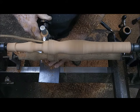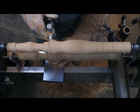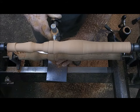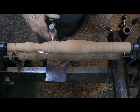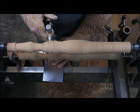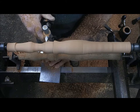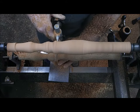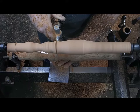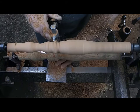A little deeper here. I'm saving my really deep cut for the end because your thinnest part — the spindle obviously — is going to be the weak link in the chain. So I'm not going to go real deep until I'm ready for that final shape, and that's when I'll plunge in and go down to my small diameter.